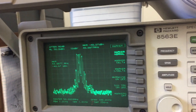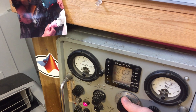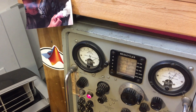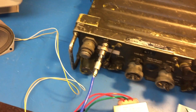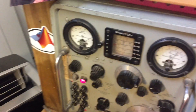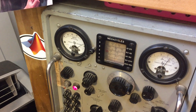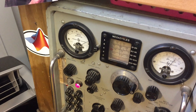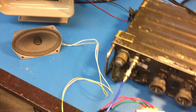If we unhook the modulation, it's picking up AC line right now, but there's your modulation. The radio is transmitting. So here we have the SIG-Gen peaked up. You can still hear it down to minus 120 dBm going through a 10 dB pad, so she's picking up minus 130 dBm, at least to the human ear. I think MDS will probably be 5 to 10 over this. It's safe to say this thing is definitely really, really sensitive.